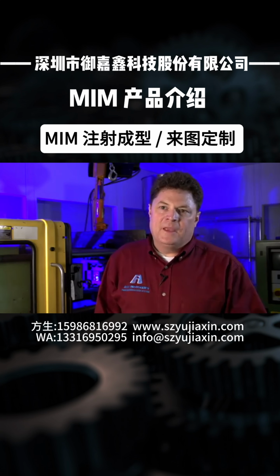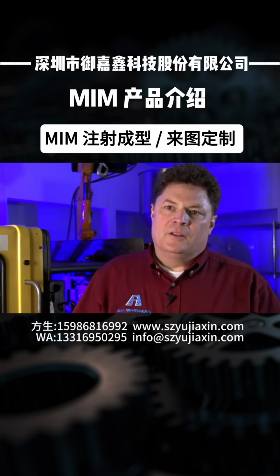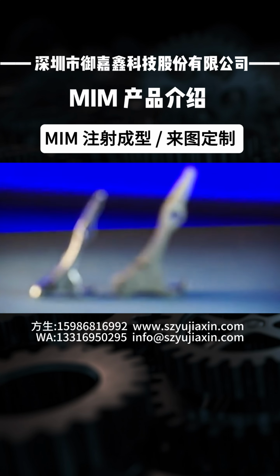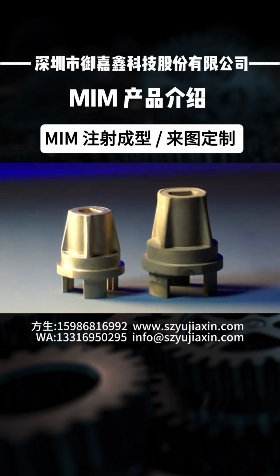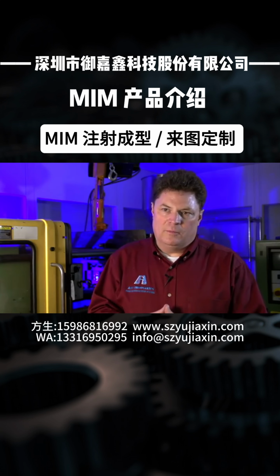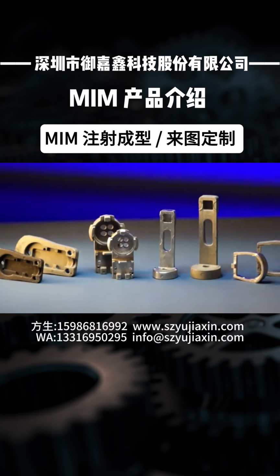Machining a metal part with tight tolerances is a very good idea in low volumes. But perhaps your volumes are picking up, the prototype has been proven, the market is expanding, and all of a sudden you're faced with machining thousands of parts with very delicate features, and your manufacturing group is overwhelmed. By molding the parts with metal injection molding, you can reduce cost and reduce the headache.